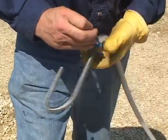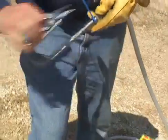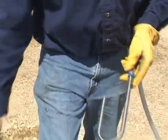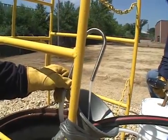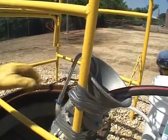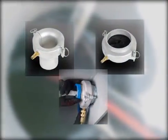The second device, a hook adapter, works best with a feeder tube or vertical conduit. Attach the hook to the output hose by sliding the hose over the long end of the pipe, then secure with a cable tie or hose clamp. Position the hook so that lubricant flows onto the cable surface that will rub on the first conduit bend. In a vertical position, the hook adapter applies both liquid and gel Polywater Lubricants.